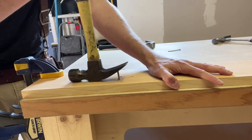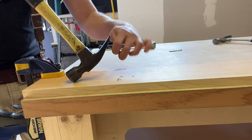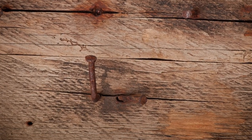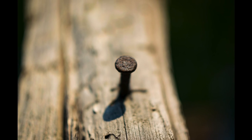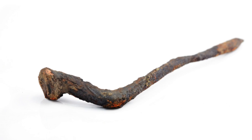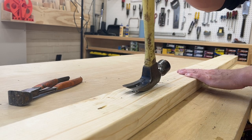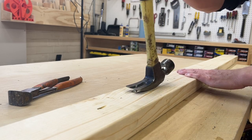A lot of people are saying: can't you just use a claw hammer to pry up partially embedded fasteners? That's mostly what the claw is for, right? And yes, I use claw hammers to pull up a lot of fasteners as well. But in the field, you routinely run into situations where the hammer fails at this job, and this almost always happens because the nail head gets compromised. If fasteners are old and corroded — like many you'll find in old fences, decks, and outdoor structures — the heads will become brittle and can deform easily with too much prying force. What you wind up with then is a nail with a narrow head.